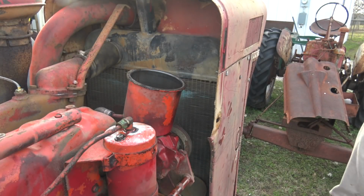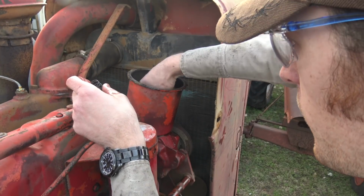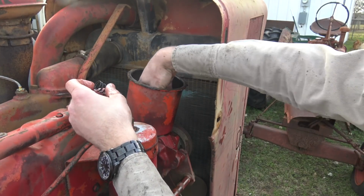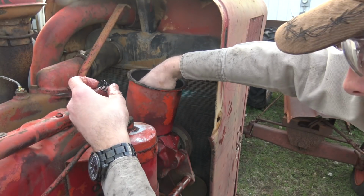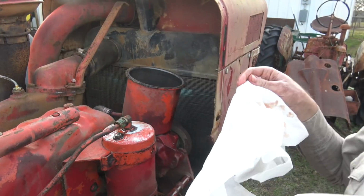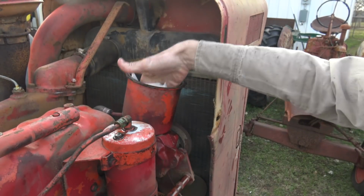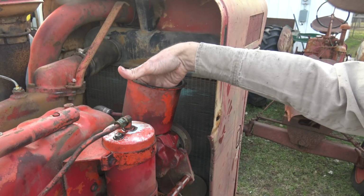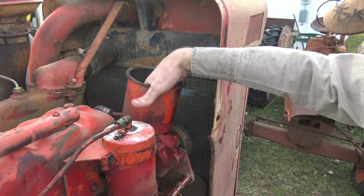Which is how new tractors are. That's how my new Kubota is, I'm pretty sure. They say it works fine as long as you put in a priority valve. Otherwise, the steering lacks. But to be fair, the steering on these lacks even when they're new, so whatever. And the good news is, because the fluid wasn't that bad, I'm not going to try to flush it all, which normally I would. It really doesn't look like there's anything wrong with it. So I don't know, I might regret that later.